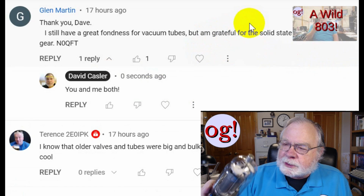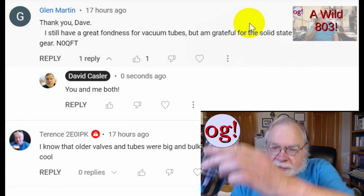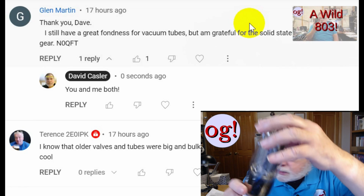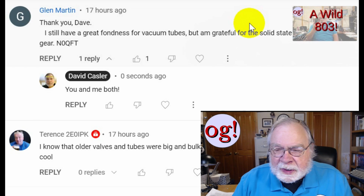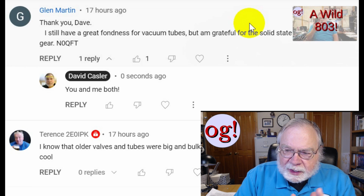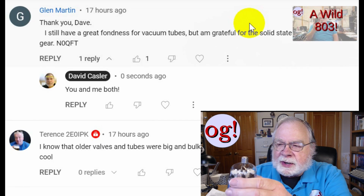It's an evacuated tube. There's literally a vacuum in there, and it won't work without it. And down on the bottom here, where you see it's kind of black on the inside, there's a little element called a getter, which is just connected to one of the voltages, and it tends to gather any gas remaining in the tube, and it causes it to heat up and splatter on the side of the tube. So what was gas becomes this black stuff down here, to get a very, very nice vacuum.